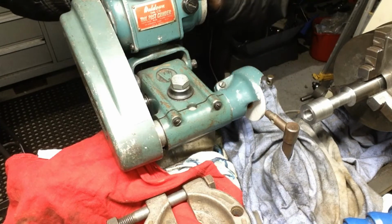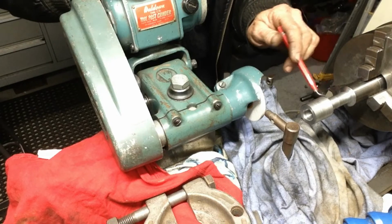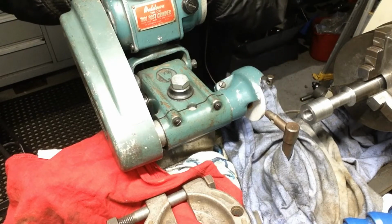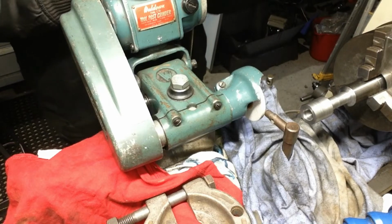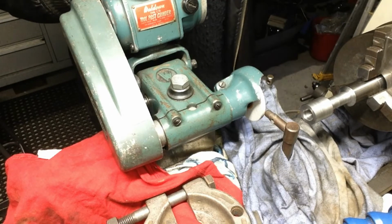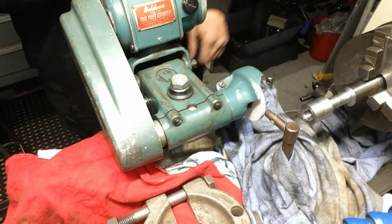Okay, well, we've got the tool post grinder set up because we're going to grind the OD of our 3/4 shaft. And then we're going to ID grind our 18 millimeter bore. So I've got one of these wheels set up from one that Dudley Toolwright kindly sent to me. So we'll give it a bit of a whirl. We'll get it dressed up and then we'll do some grinding.